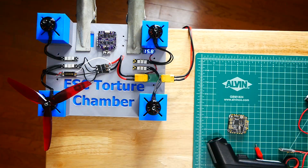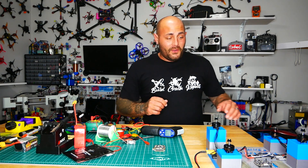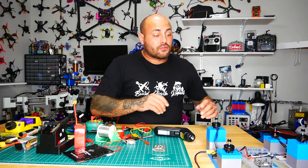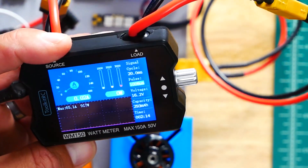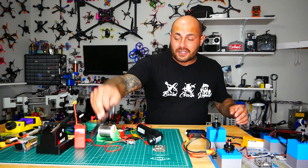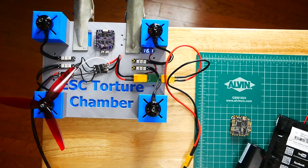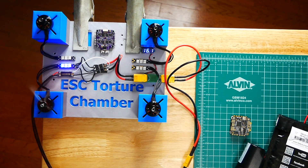I smell something. Yes, it's a little warm. Motor is hot — 130 degrees. The motor can't handle it. 65 amps, 917 watts. 65 amps through this little guy right here. And just to show you, we didn't blow it — we ran 65.1 amps and it still works perfectly fine.